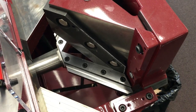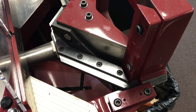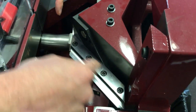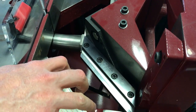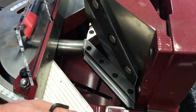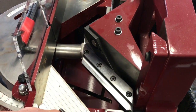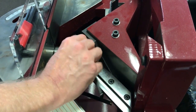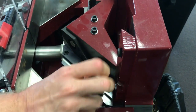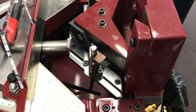Once you've tightened up all these screws, you can see that all the way along there's little or no gap. If there is still a bit of a gap you can loosen it off. You might want to do both sides at the same time — unscrew the right hand side, loosen the left hand side, pull the under knives out, then push them in and do your front ones at the same time, your next ones left and right. Just be careful — it's an exposed blade so you don't want to cut yourself. Try the method I demonstrated by starting with the blades down in the safe location and removing the under knives to do so. Once you've got them all lined up, give them a nice firm tighten, then with the blades down put the rebate supports back into their tracks and you should be ready to go. That's how you can close the gap on your guillotine blades between the top blades and the under knives.